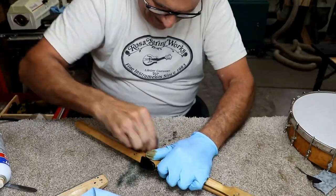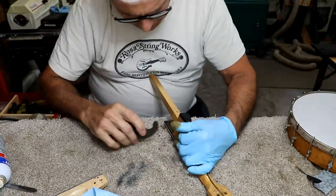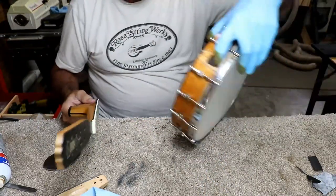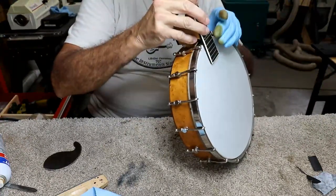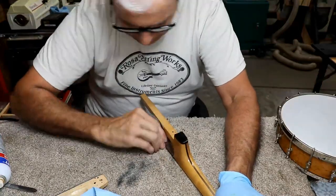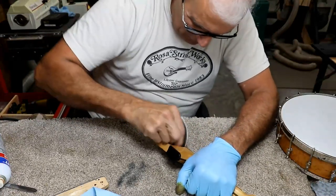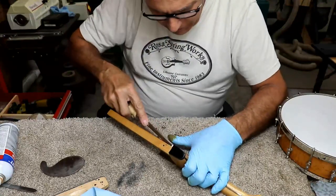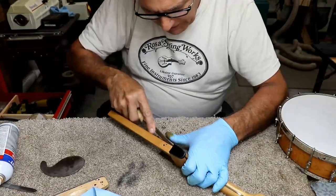This is not really doing anything under here. The problem is I can't get to it very easily because of this stick on top. My problem with cutting away more of this hole up here is that it keeps raising me up higher and I'm already above this hole. That's pretty much bottomed out. I don't want to break this again. Using a chisel is an option, but not a good one because you're cutting into the end grain and it could knock a lot more off than you want — knock out a big chunk. But it is cutting it and I might be okay.